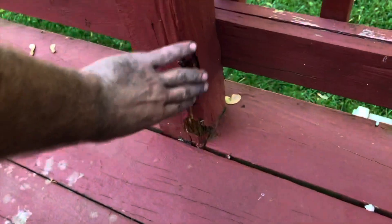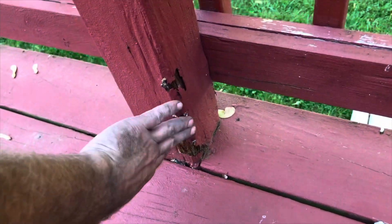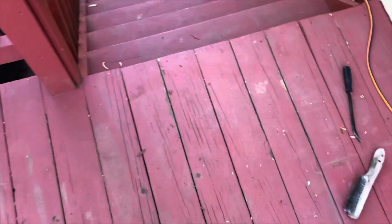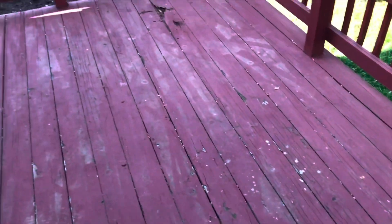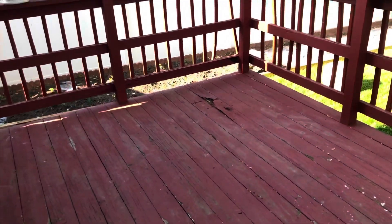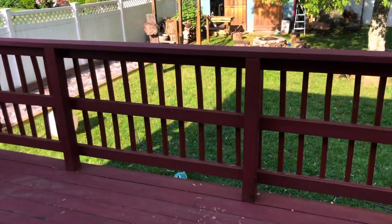For this section - maybe about six feet - I'll get some thin one by fours, pressure-treated beams, to cover these up. This is all dry here so we'll take some of this off and cover it up like it was done over here, which seems to be holding up nicely. This isn't really the proper way of doing this, but it's just a quick restoration on a budget. We'll get some solid deck paint and hopefully it'll hold up for a couple years.